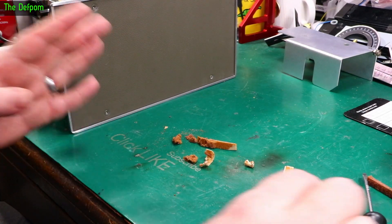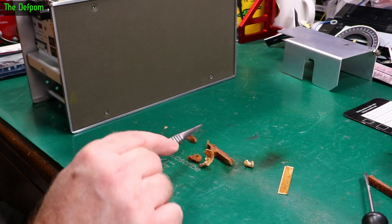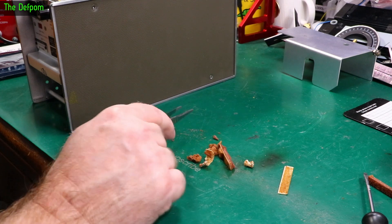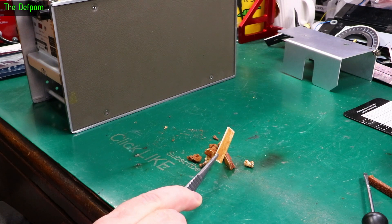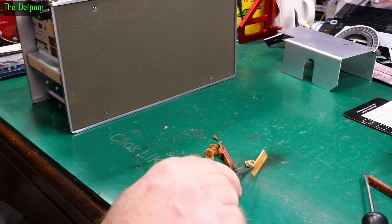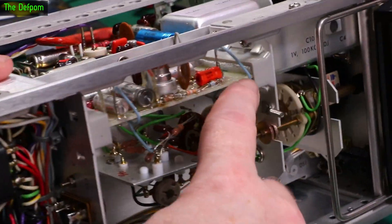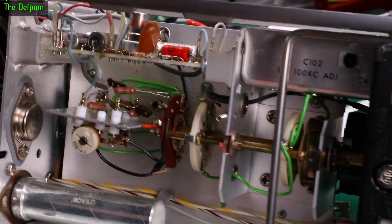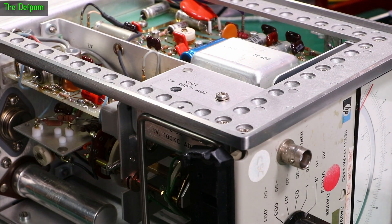So I've checked the capacitors and so far so good - it all tested okay. Here's the foam I've taken out - you can see it is disintegrating and starting to turn into dust, so I got there just in time. This is actually what they used - it's a bit of double-sided tape that was used to hold it in. Time for the new foam. Alright, the new foam is installed - you can see there and in that side. So that's good as new again, at least for maybe 10 years or so until that foam degrades.